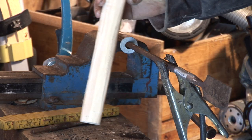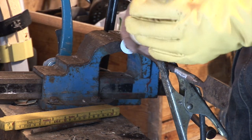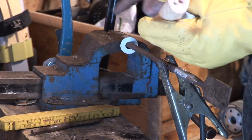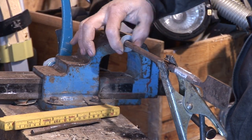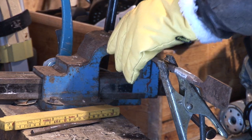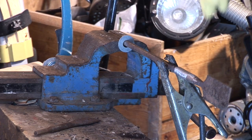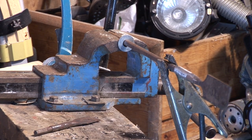I'll go outside and split this from Ashwood. I've drilled a hole in it and kind of made a temporary lathe here using the drill. The hole is 8cm long, so I'm going to weld the washer on at the 8cm mark so that it butts up against that surface. Because I don't really want the blows to be transferred right into the back of the hole of the handle, because that's what makes it more likely to split.